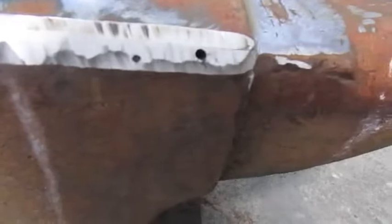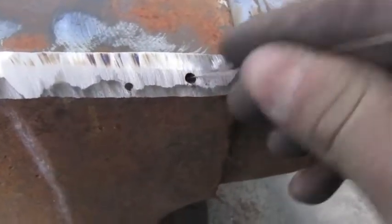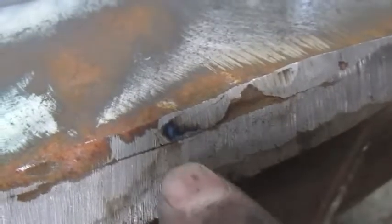This is something that I had feared with a cast iron anvil — these are impurities in the casting. There are holes; this one goes quite deep. And you can actually see the transition between the cast iron and the steel. The cast iron below looks a lot different. You can see the steel, the line, and some imperfections in the steel where it didn't quite weld with the cast iron in multiple places. This is why the steel face on these Vulcans can crack.